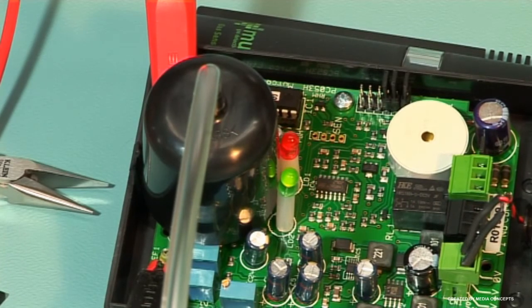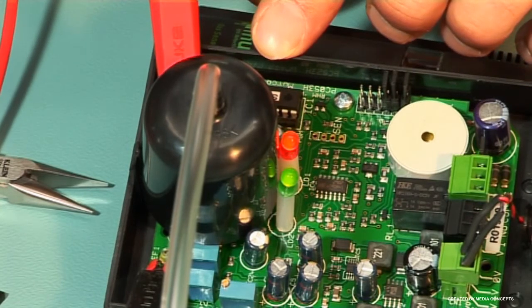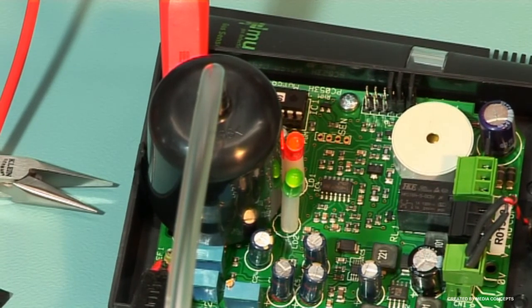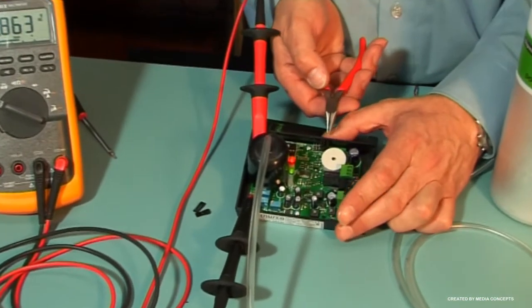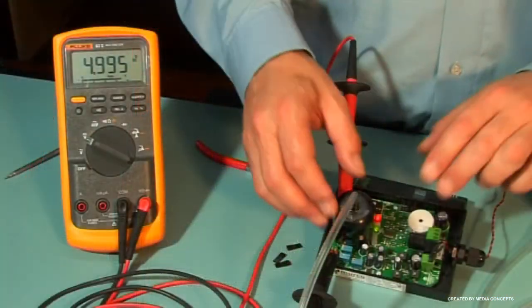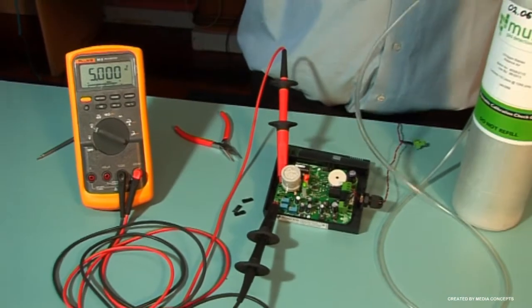The MGS will now be in alarm and the sounder, if enabled, will activate. The relay should also activate if the MGS is connected to the MGD panel. Then the yellow and/or red LED on the MGD panel should be lit. The sounder can be silenced by removing jumper JP2. Remove the gas and the unit will come out of alarm and return towards 0 volts.